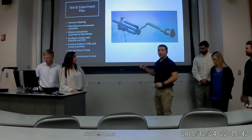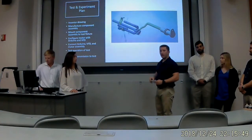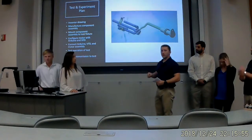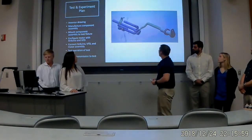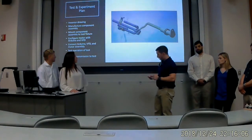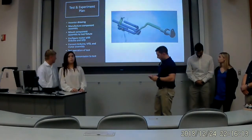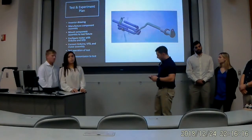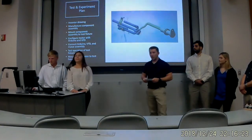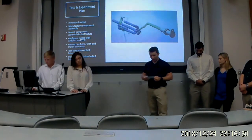To make this work for testing, we're going to have to get a 3-phase motor and connect it to a variable frequency drive on the input shaft of the transmission, so we can test the transmission under full load. The test fixture simulates a vehicle's internal combustion engine and the operator's input. The Arduino controls the VFD by issuing output signals to the VFD, which vary the speed of the 3-phase motor. This allows the electric motor to drive the transmission input shaft at varying speeds. The Arduino controlling the VFD generates an output signaling load to be processed by the Arduino controlling the transmission.